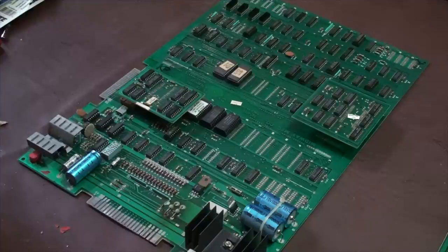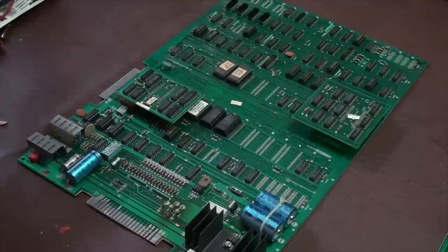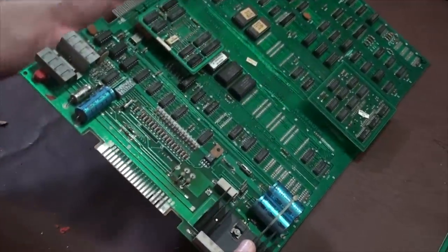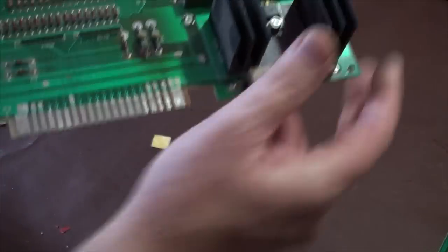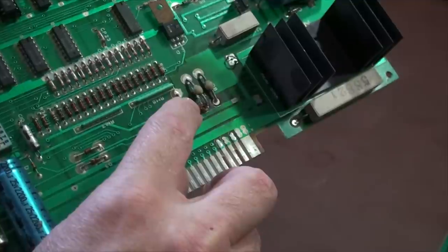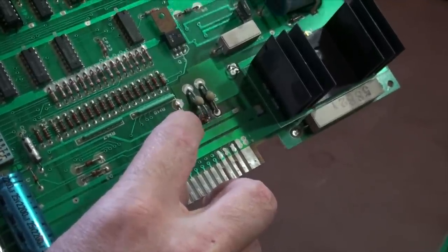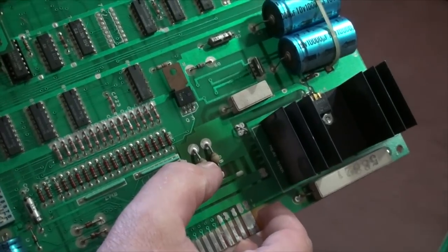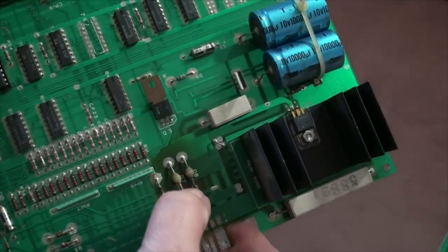But replacing a diode, same thing. Make sure it goes in the proper direction. And they'll have, let's see, does this guy? Yeah, this guy has it. How nice of them. It's almost foolproof, right? Underneath this, they even got the marking that shows you the direction that it's supposed to go. And diodes will usually have some type of line that kind of also tells you. So I can push this guy back in where it belongs and I can solder it up.